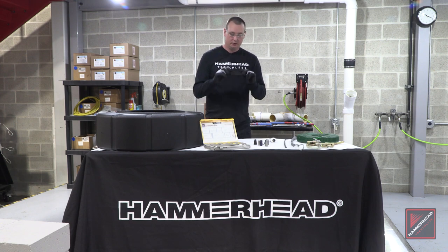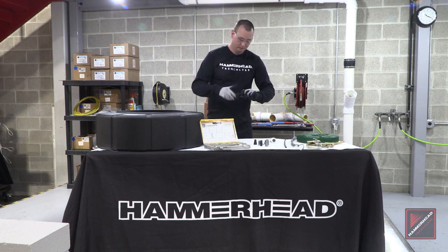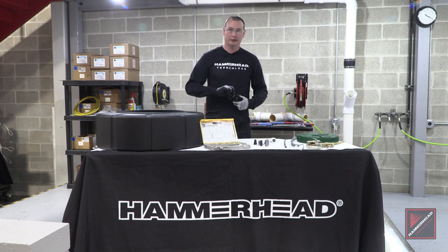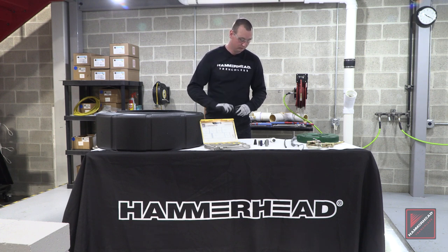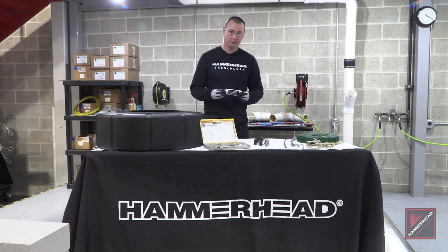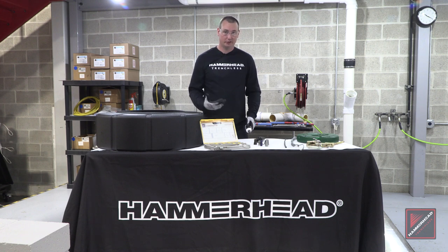The next item in the kit is the large expander we've been talking about. This opens up and inside is where you'll place your collet. Once the collet is inside, we insert the cable. You want only a quarter inch of the cable hanging out behind the collet before you put the nut on, or else it will not fully seat — and if it doesn't fully sit, you run the risk of leaving your new product pipe in the ground and not getting the lead out. With the expander there's also a tube of anti-seize — this is going to be your best friend. Always make sure you lube up the collets before you put them in the expander, otherwise you'll need an air chisel to break them free and sometimes you'll destroy the expander itself.